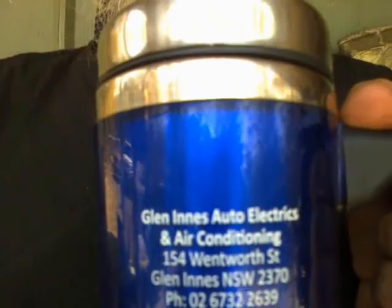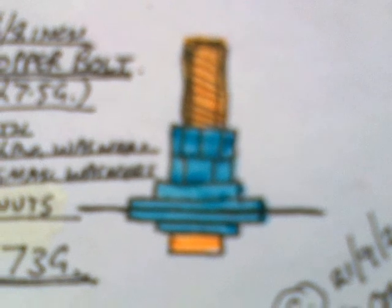So therefore, I, who have a son who is an auto electrician, remembered that I'd seen some things that could be helpful in his workshop. It pays to notice little things, because in his workshop my son has some really big solid copper bolts, and copper conducts heat a lot better than steel does. So, a big 3/8" diameter copper bolt with a square head on it, 2 large washers, 2 small washers. The 2 small washers have to be there because the thread doesn't go all the way down the shaft, and we need them for spacing. However, I've come up with a better arrangement than the one shown in the drawing, but I did such a good job on the drawing, you're just going to have to put up with it.